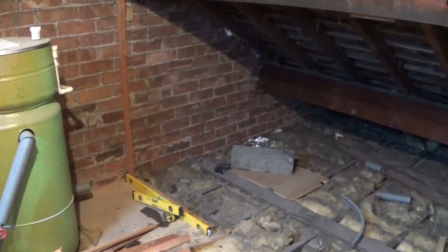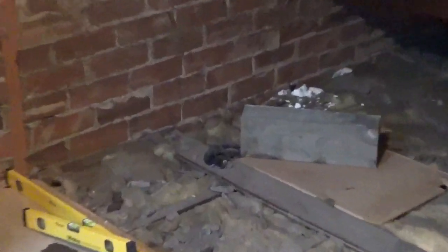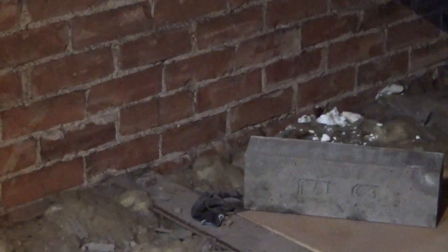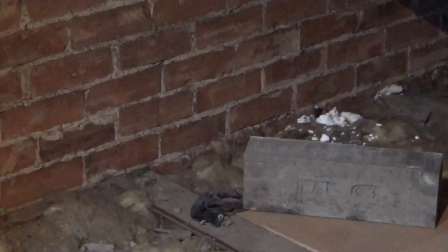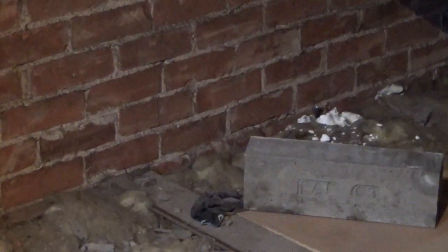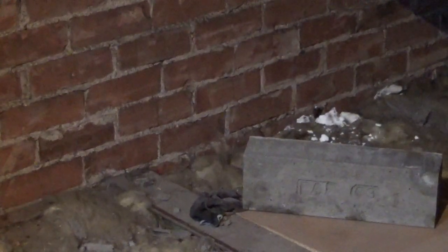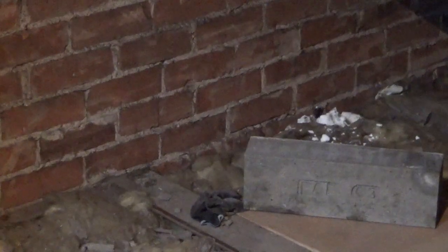My job I want to start today is put the pad stones in. So that's a pad stone I bought from Jewson's. It's 140 deep, 440 long, and 100mm wide, or however you look at it, which is basically what was spec'd on the specification for the steel.